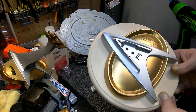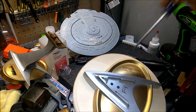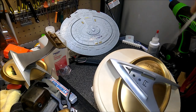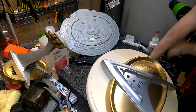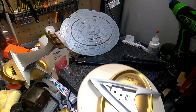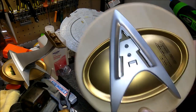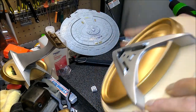They're machine screws, so what I did was take my Phillips head and, after drilling the tiny one-sixteenth inch hole, just kind of reamed out the wood a little bit on each of the pilot holes so that the machine screw would have something to grab onto. It screwed right in. This is basswood, which is a pretty soft wood, but it's nice and thick.